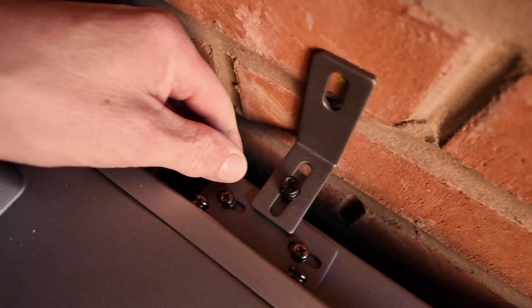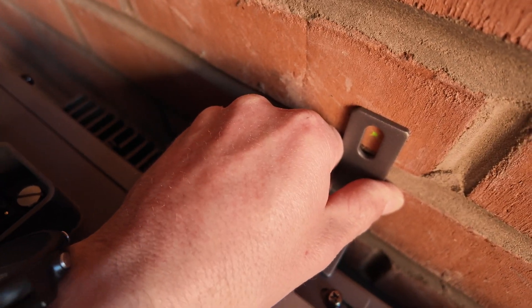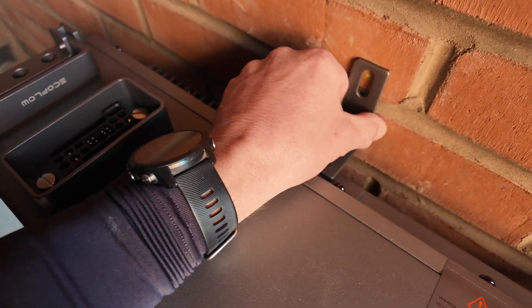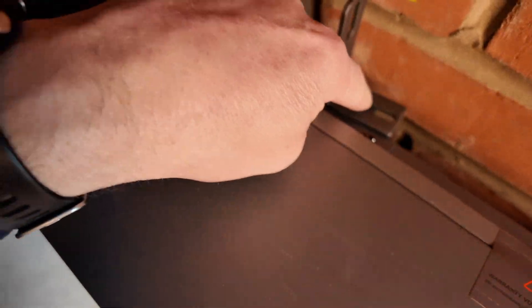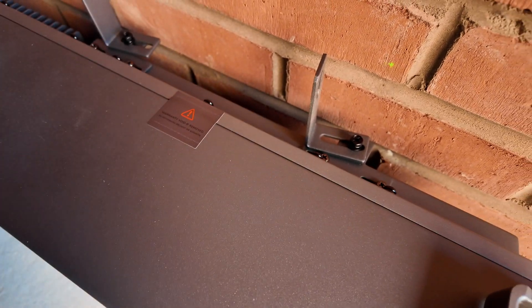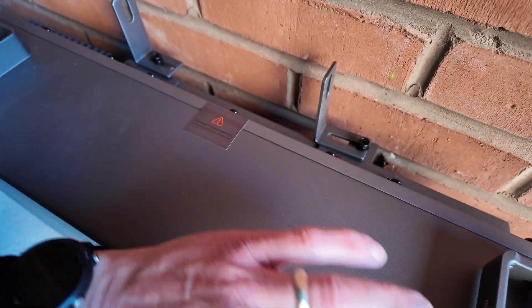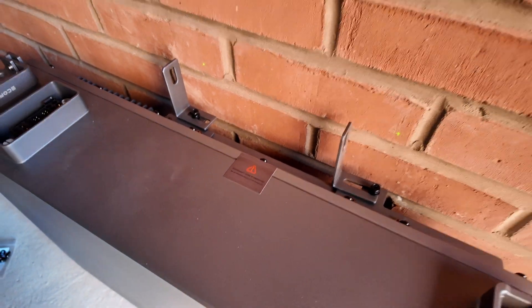On this one we've bolted it to the back of the battery and managed to get that in — so you can see we'll be able to drill that nicely. The good thing with these brackets is, because we haven't tightened up this bolt here, we can actually move the bracket out the way, get the SDS drill on, drill that, and have the vac on while we're doing it so we're not making a mess.